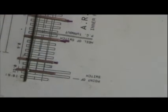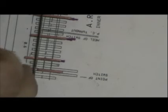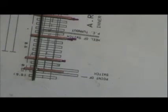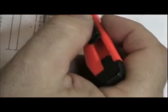Nice, clean joint. And the fact that you spent the time to cut the solder into discs gives controlled amounts of solder, so you don't overdo it, and it gives just enough to secure the rail to the PC tie. Now I'm going to jump over here and solder over here, because right here you've got a little bit of a gap between the side of the rail and the line on the template. Well, that's because we filed the base away. So you're going to do line of sight again, base of the rail with the line drawn on the PC. Okay.